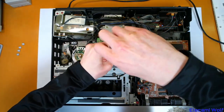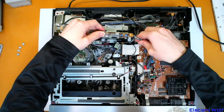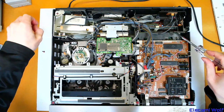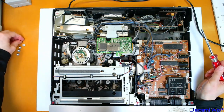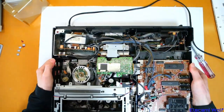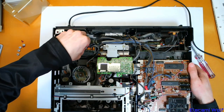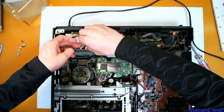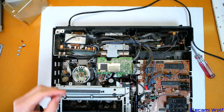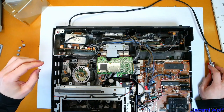I think this is the hi-fi audio — it's got an add-on to the regular non-hi-fi design. Hi-fi audio amplifier. There are more regulators over here, and a heatsink around there with two more components on that. Looks like a fuse has been replaced there. The fuses normally have this coloured band on them so you can tell the value, but that one is different — it doesn't have that. I wonder if that's been replaced. It's one amp. I'll just check that — it's alright.